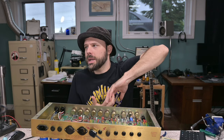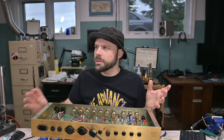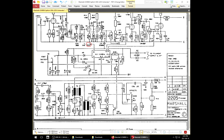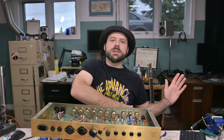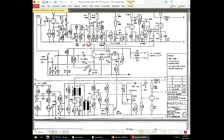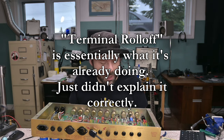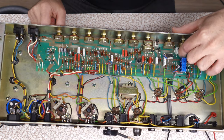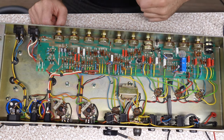When you put this capacitor to ground on it, it loads it down in such a way that it cannot vibrate. Normally this is used in tone circuits to suppress vibrations in certain frequencies, but when we put a large enough value capacitor like a 0.22, it's essentially rolling off all the high frequencies. It's like you put a tone knob on it that rolls off all the highs in the effective guitar range but doesn't actually mute the circuit. There are four 0.22 capacitors here, and possibly another one that is part of that circuit.